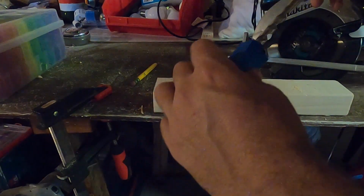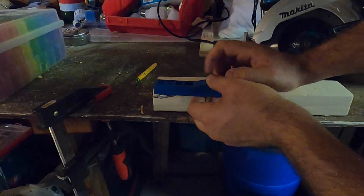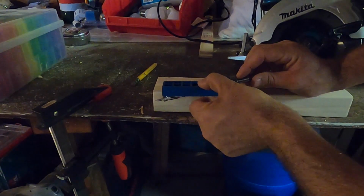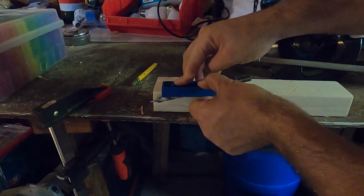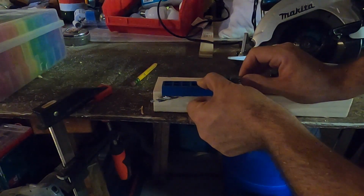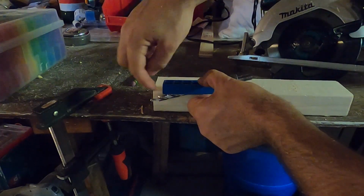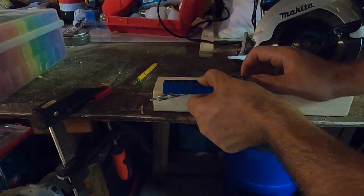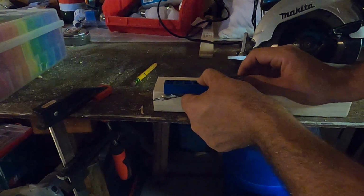So basically how I use this jig is I loosen the collar all the way, and I put it on the very edge where it's still going to have contact. It's going to be even with the top. And then I just push the drill bit in until the very tip of it is poking out. There's still enough meat left on the shoulders that this isn't going to blow out the corner. I actually like it even a little bit less than that.